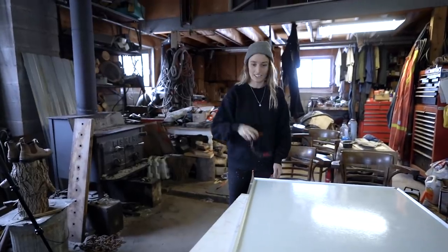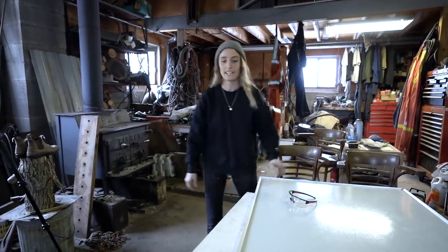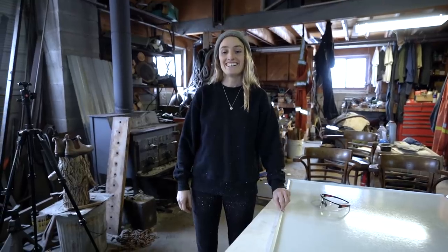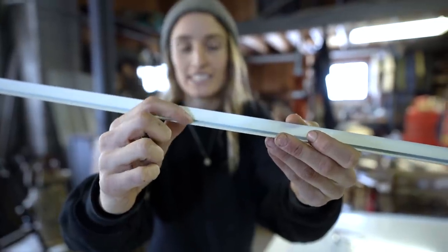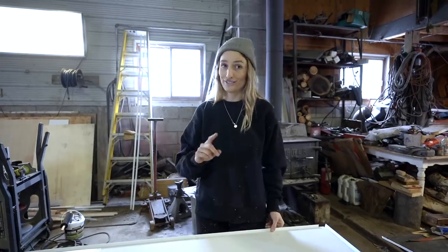This stuff is actually really good when installing a shower because it just helps it be more watertight. It is an inside corner, and it looks so professional. It makes your shower look really professional. If you can see, FRP, one of them goes in here and the other one goes behind there. That way you don't have to put a thick bedding of caulking, which in the end is not going to last forever. So this helps, especially in a van.